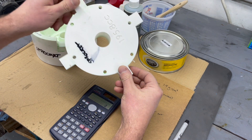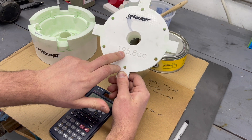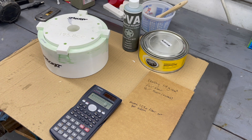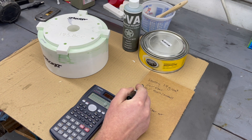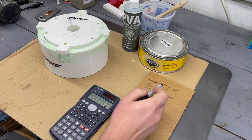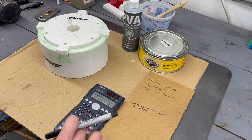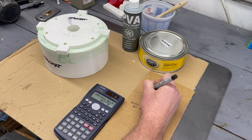So, how much resin and fiber do we need to fill this part? When I'm designing the parts in CAD, I take a quick volume measurement on them. I've been printing it on the A side of the mold so that I've got that available for reference. We have 195.8 cubic centimeters. The carbon fiber and resin assembly when all pressed and cured to the 60-40 ratio is 1.4 grams per cubic centimeter. So we need to have a 60% fiber there. 195.8 times 1.4 times 0.6 is about 164 grams of carbon.